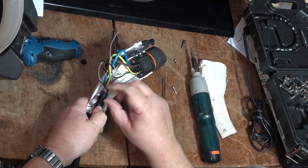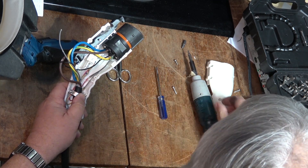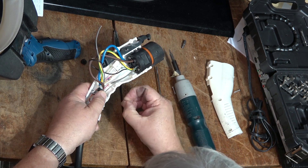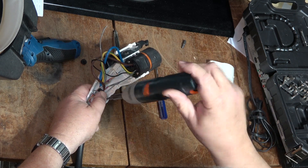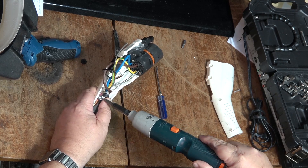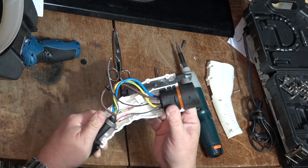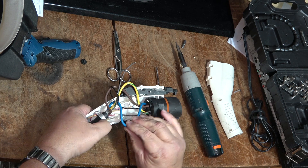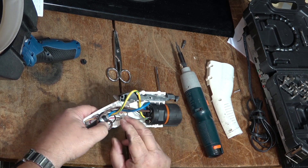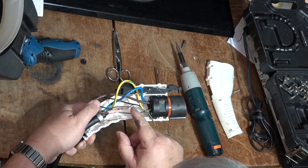This gives you a good idea of what's inside these Chinese charge cables. They do have good heavy wires, so there's no problem with the wiring. Those thin wires are just for signaling — for the pilot signal, for example, which tells the car how much charge current the cable is capable of delivering. The actual conductors — the yellow-green which is the ground, and the blue and brown which are the two hot lines — they have ample current capability for 15 amps. There are only four wires to tuck in; the fifth wire is not used — a couple wires go down through resistors for the switching network.